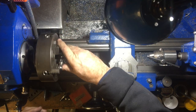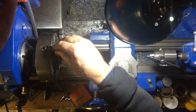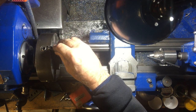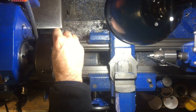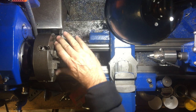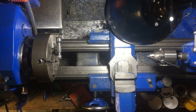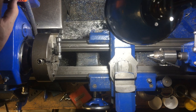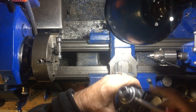You'll hear a bit of loud noise in a minute — this is the fan in the speed controller for the direct current motor I've now installed. In the top left-hand corner of this picture you can see a silver box, which is a stainless steel cover for the DC motor. It has a lot of air drawing through it with a fan, and it was sucking swarf into the motor. So I put a stainless steel box around this end where the swarf is; the other end is open so it gets good airflow.